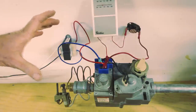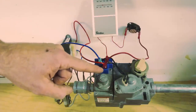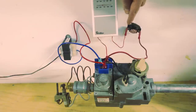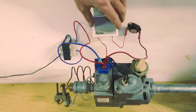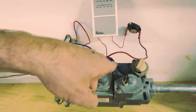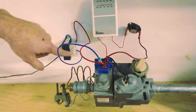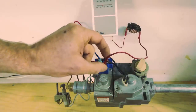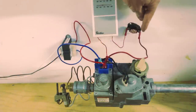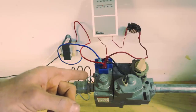Here's our second setup. We have our 24-volt wire coming out of the transformer over to the TH-TR terminal, and then it's junctioned over to a wire which goes to the high heat limit switch. The 24-volt hot comes into the thermostat, and on a call for heat, 24 volts comes back out over to the TH. It then follows a black wire over to the solenoid, powers the solenoid, and comes back through the common which goes to the common side of the transformer. All this TH-TR is just a junction spot. Sometimes you'll find the wires connected directly here instead.